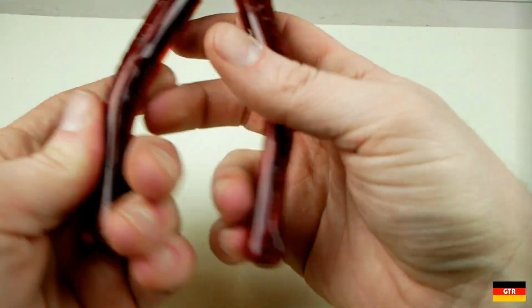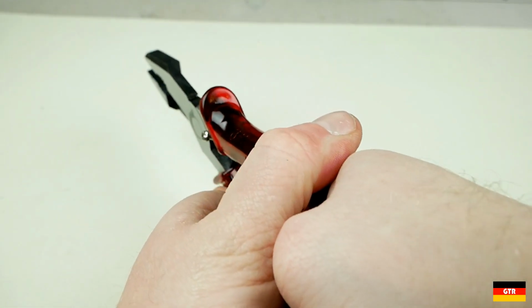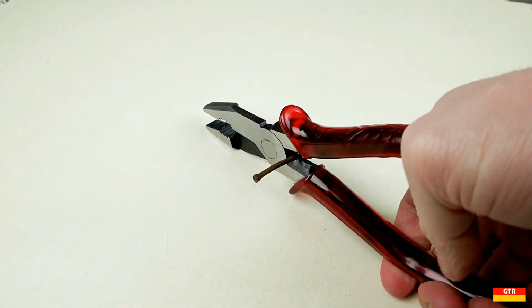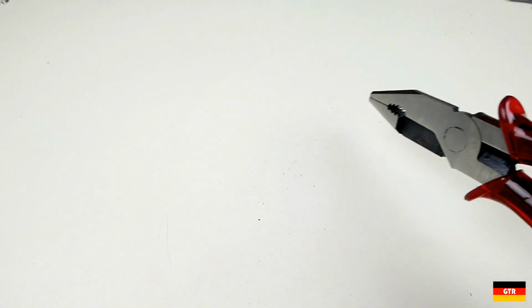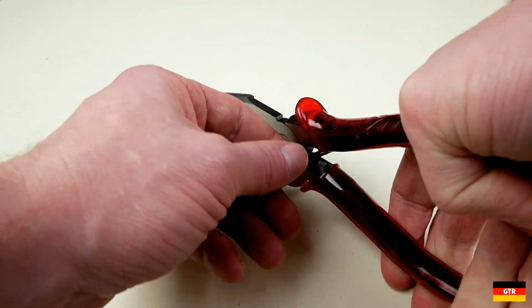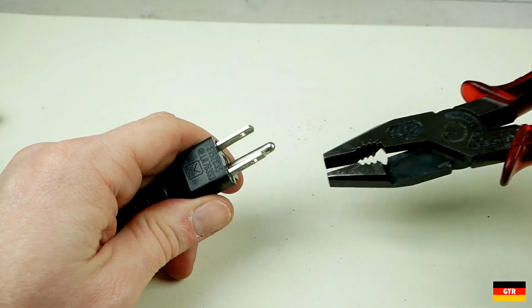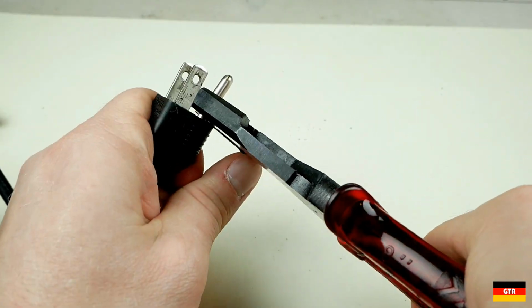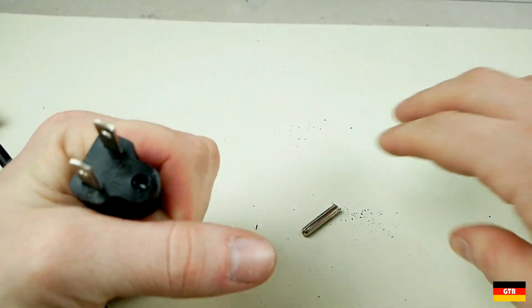Another function that these pliers claim is the ability to cut screws, which they indicate as a nipping action. Just below the joint are cutting surfaces similar to a side cutter that can be used for this. I tried this and it certainly works on moderately sized screws and nails. For larger ones you're going to have to use another tool. As for the gripping feature, the hardened teeth are quite sharp and perform much like any other gripping pliers in this class. Again, you'll notice all this black material coming off the pliers, and that is from the unground heat-treated shearing surface.